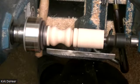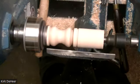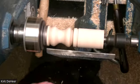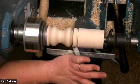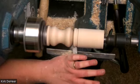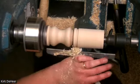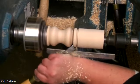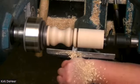I will admit I've turned at about 3000 before, but the trick is you have to bounce up and down to get that negative rake. As you're turning, you'll get a really nice round ring. Just back and forth, back and forth. We're going to flip the tool over now that we've got that started — flip the tool over and do the same thing in the other direction. Your whole body is moving as you do this, and just bounce up and down to get that nice round ring.